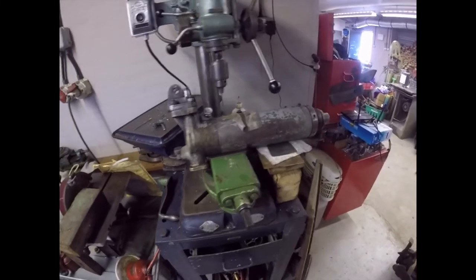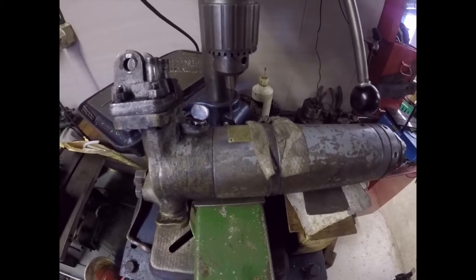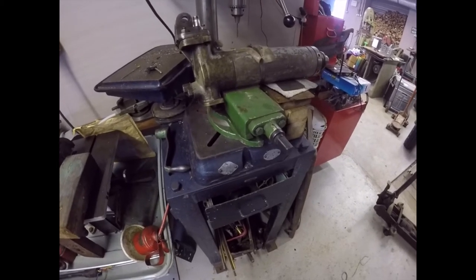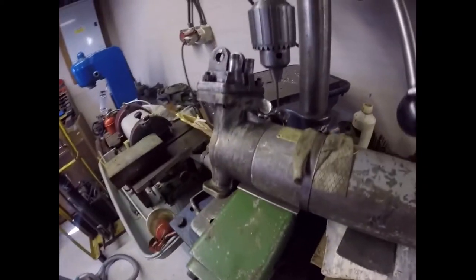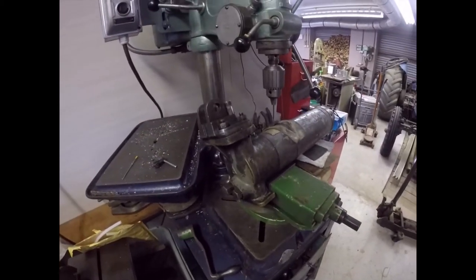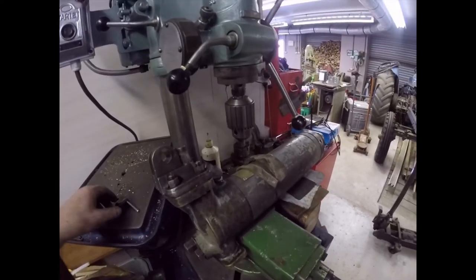It's a rig to re-drill the holes in a slightly different place because I couldn't get those tiny little rivets out, and the job's done. I assumed I'd have a machine vise big enough to hold that but I actually haven't. I've had to rig and pack and level and get it near enough, and then get it bang on under the drill so that I wasn't drilling an extra hole in the bloody plate. Like these cowboy rigs very often do - it worked perfectly. Three thirty-second hole, not very big.